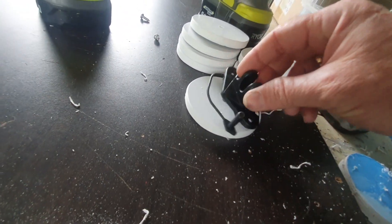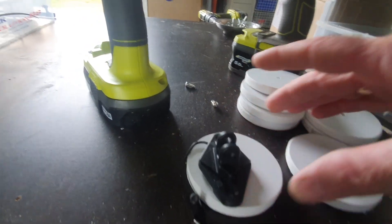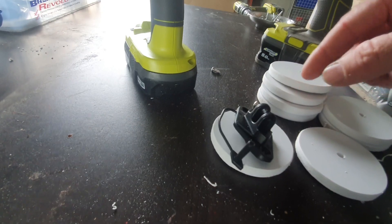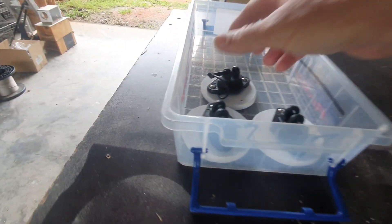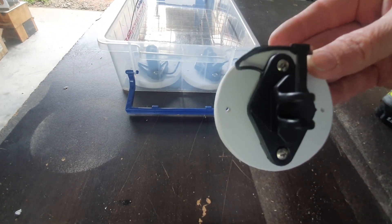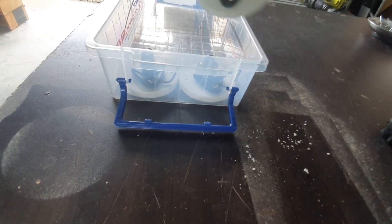These are the insulators I've bought from an electric fence supplier. I drill a couple of holes on there, then I've got some stainless steel screws which I screw through those two holes. I put two holes on the side and pop rivet those onto the actual aviary sheeting. This is a finished one here, ready to be put on — it just keeps them a little bit further off the aviary so I can make sure I'm not going to touch the steel and make the whole thing live.